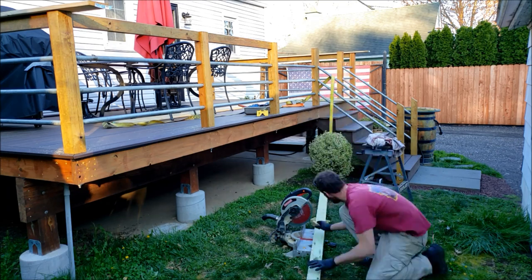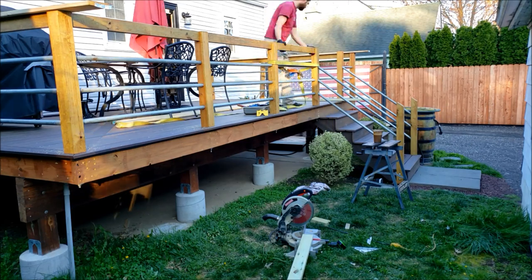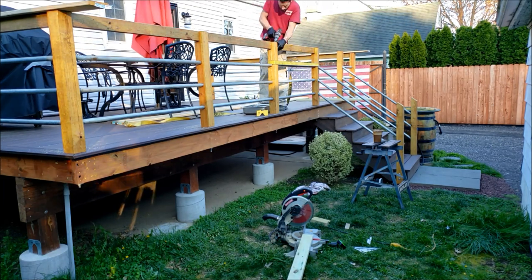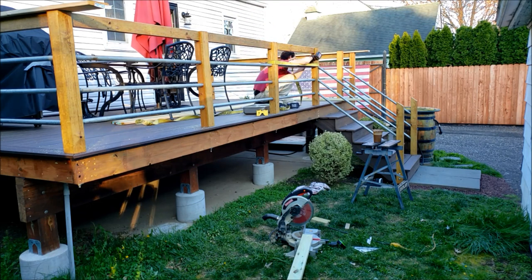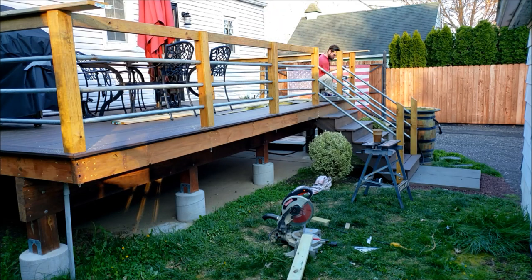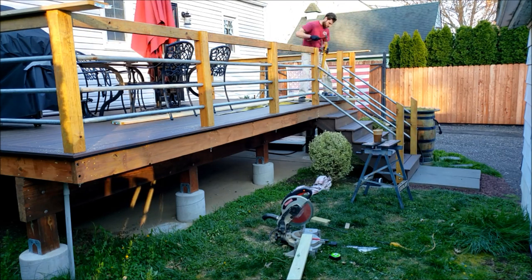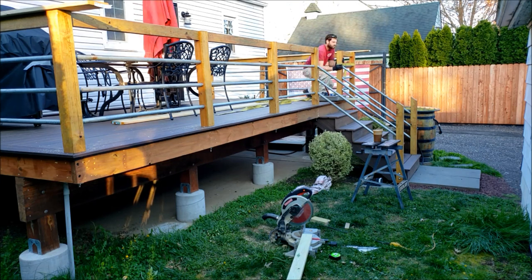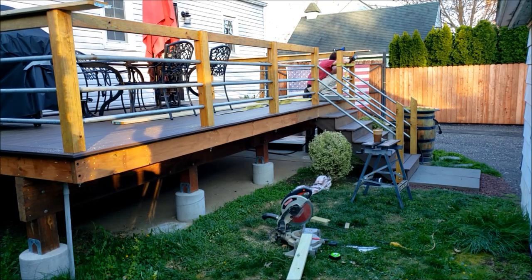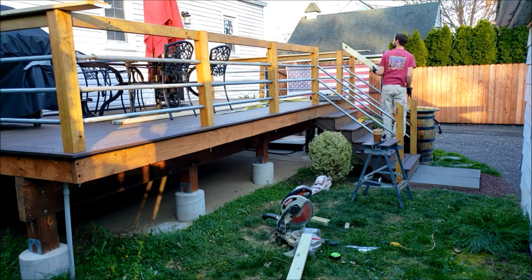I feel like it got a little boring toward the end, but if you plan on doing a conduit railing system like this, some of these tips should definitely help you out. In this time-lapse I'm putting up some of the two by fours between the posts — you can see I'm using a ratchet strap to butt them up real tight and screw them in place, and then that five-quarter board on top holds everything together. If you want a video on setting up the stair posts, let me know in the comments. Any comments or suggestions are appreciated. Until next time, this is Chris Brown, no-nonsense know-how — see you in the next one.